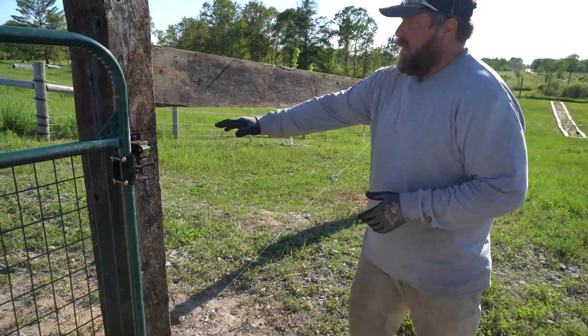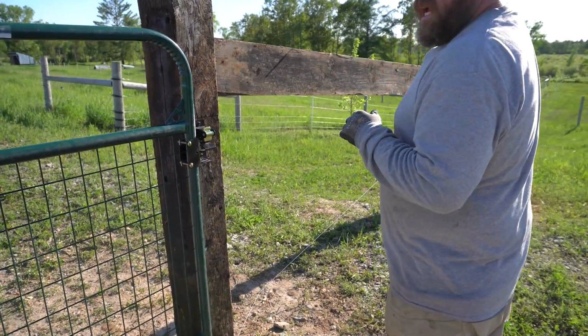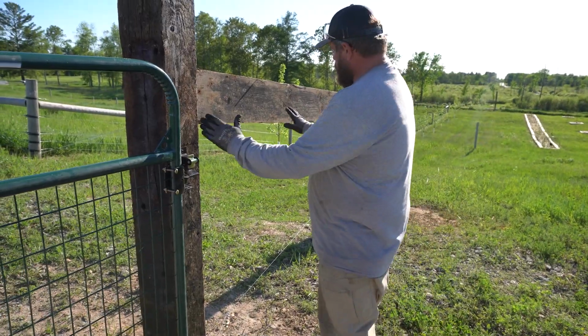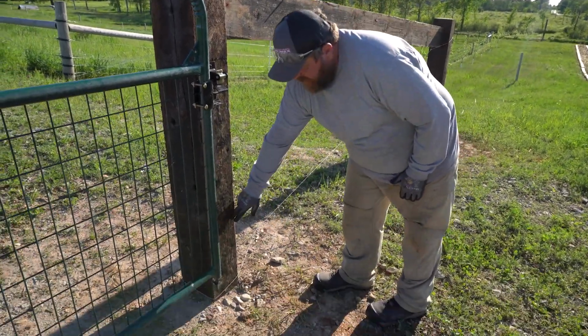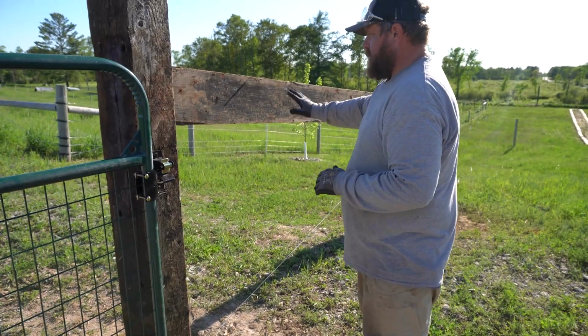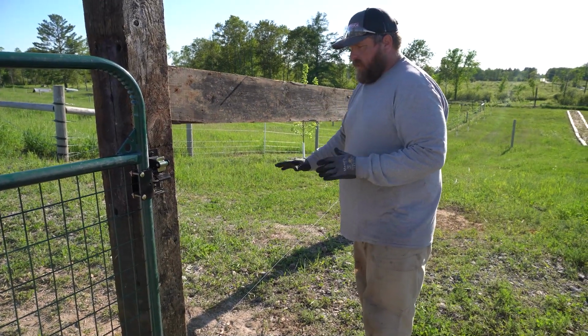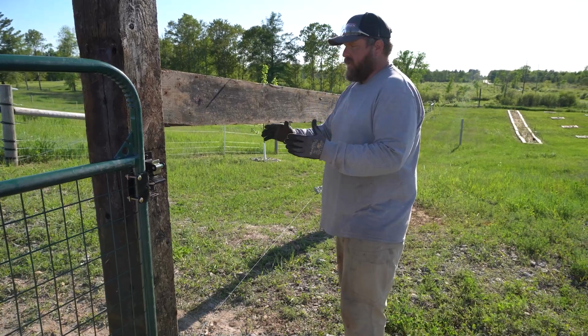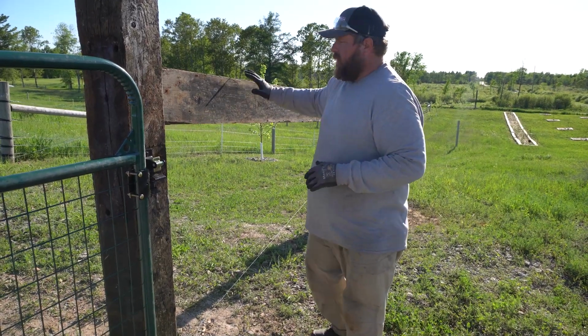So you can see this is going to run down the line, so you're going to have a whole other string of wires pulling this way. So it's the same thing, that you have to start at the bottom where the tension is going to get pulled in the opposite direction. So get your orientation done properly, and then you can put a bunch of wire and a bunch of stress on here, and this H is going to hold up really well.